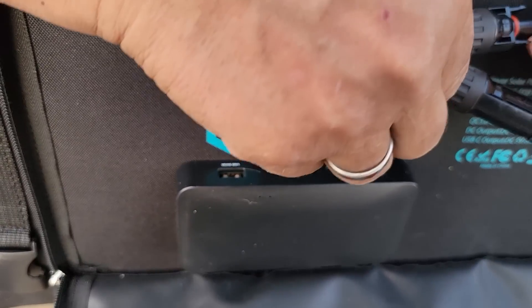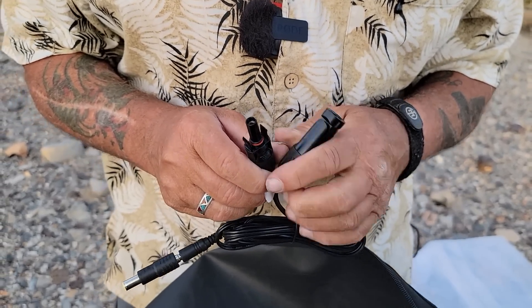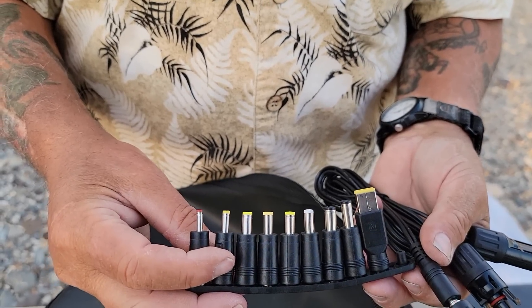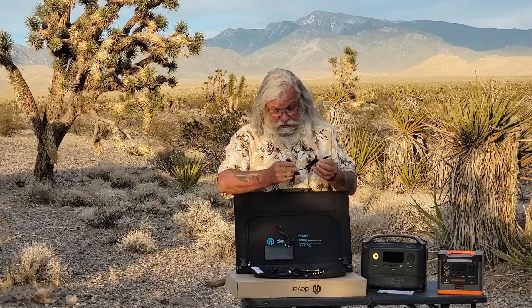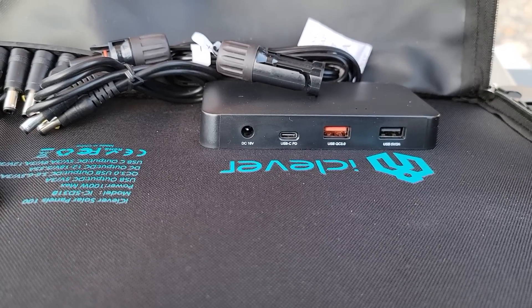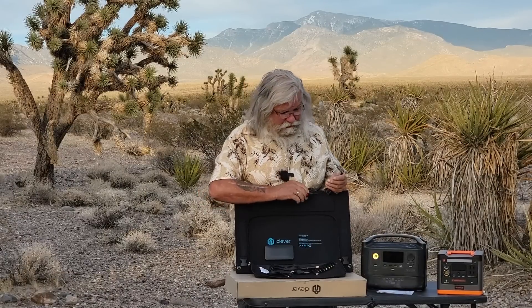This looks a little better quality, and the cabling comes in a nice little bag along with the controller — very similar overall. This is again probably an 8mm adapter for the Jackery. The MC4 connector goes to their little plug, and the Jackery adapter lets you plug the solar panel straight into the Jackery. It also has an Anderson connector, which is handy. Something that really impresses me: it has a USB-C PD port, which would charge a battery bank really fast. That's a big plus.